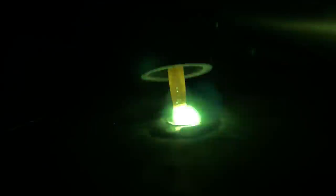When I'm teaching people how to TIG weld, whether in person or in my online training program, whenever people dip, we have to take a look at what happened before they dipped. And there's something I always see pretty much every time — it can always be called discomfort. Anytime somebody has dipped, it has usually come from one of two things: having your hands uncomfortable or shaky, or not having proper vision. I'm actually gonna simplify this even more — the second thing I mentioned is usually caused by the first thing, so you could argue maybe it's just one thing.